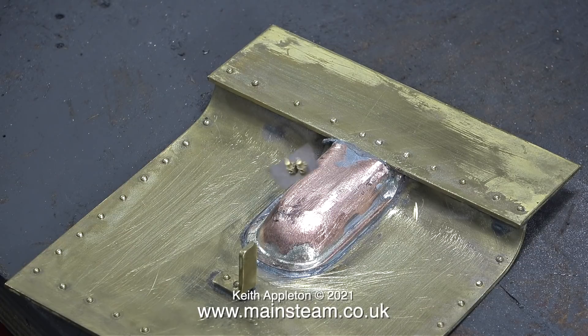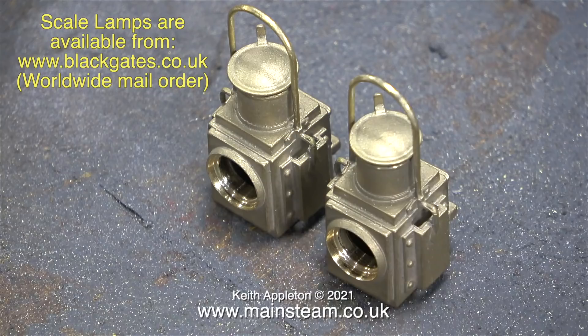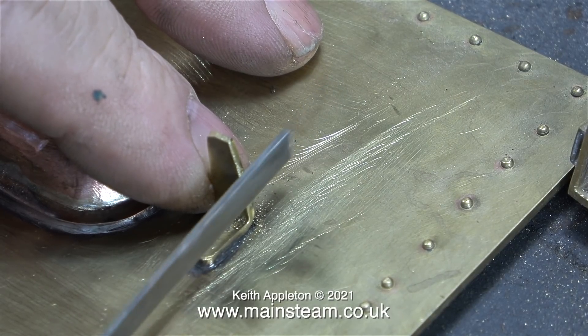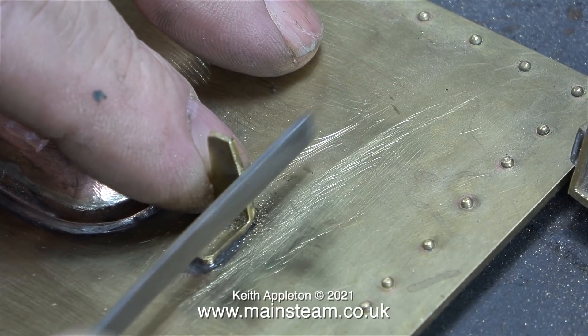I would like to mount a couple of these at least on the front of the engine. I buy these from Black Gates Engineering and they are lost wax castings of Great Western style railway lamps. Great Western railway lamps, as far as I can see, were different to everyone else's - instead of the mounting fitting being at the rear as is normal, Great Western railway lamps have the mountings at the side. The only problem is the main brackets on the engines are often too thick to fit in these mountings, so they need a little bit of trimming. This is no exception.